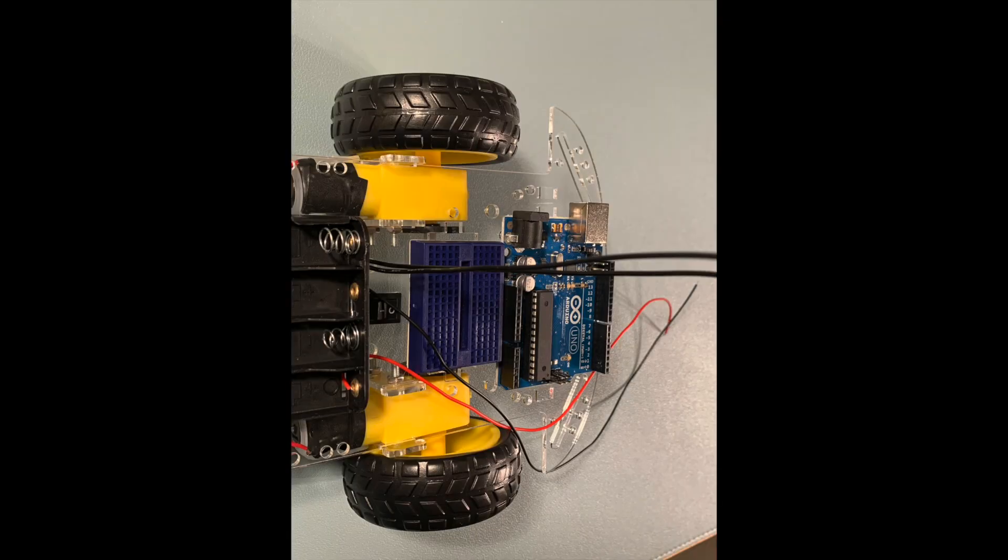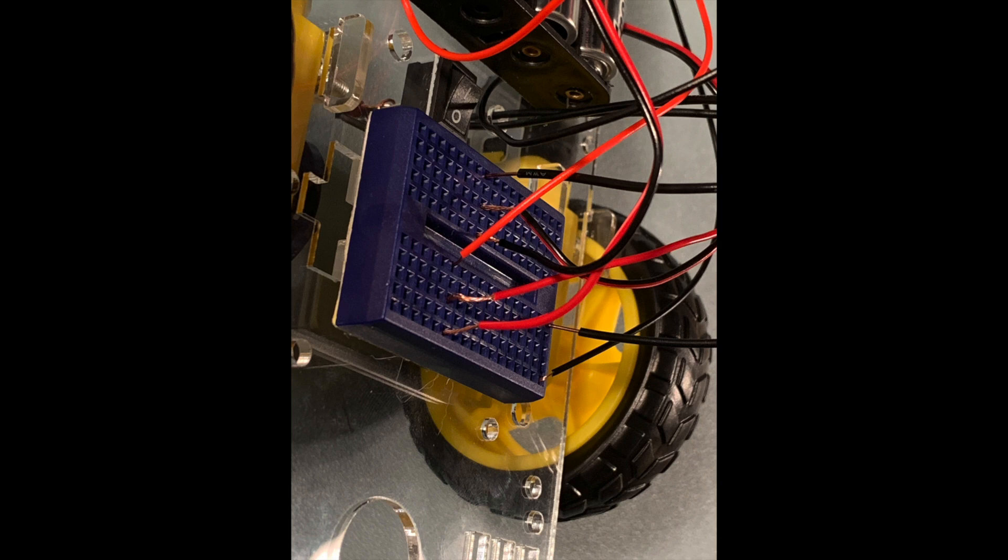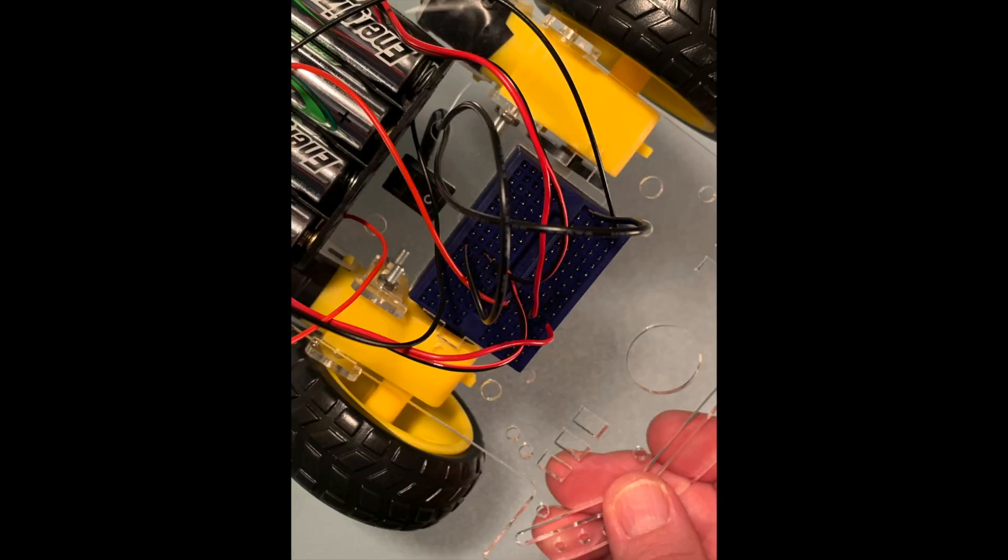Now we can move on to wiring up the circuit. Since I'll ultimately be adding an Arduino to this robot car, I've attached a mini breadboard to the chassis simply using some double-sided tape in the event I want to remove it in the future. And you can see there's plenty of room left for the Arduino or Raspberry Pi if you choose. For the wiring, I ran one wire from the power switch to a row on the breadboard, then the negative wire from the battery pack to the same row. In another row, I ran the other wire from the switch to the breadboard, and the negative wires from each motor to the same row. And finally, I ran the positive wire from the battery pack to another row on the board, and the positive wires from the motors to the same row. I know it looks a bit of a mess right now, but I'll come back and clean it up when I move on to the next video and add the Arduino.